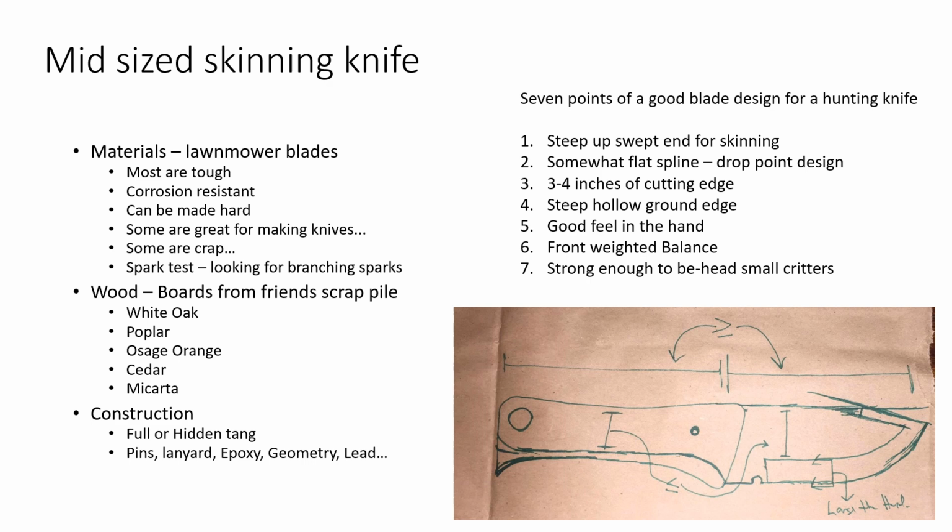I don't know what the heck those things are called. We call them Easies because that's the nickname of one of my friend's sons. He comes to the shop sometimes and makes knives. We call him Easy. He saw this in a picture on the internet, cut it in. I said, dang, that's actually kind of pretty. And so I started putting them in mine sometimes. The key with those is to remember to do that before you harden the blade. Otherwise, instead of an Easy, they ought to be called a Hard as Hell, because it's just not fun to do.